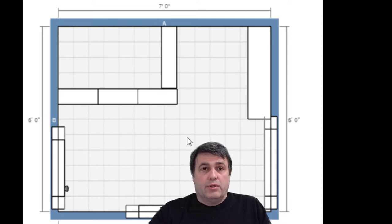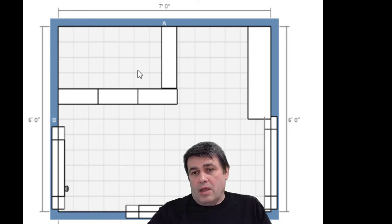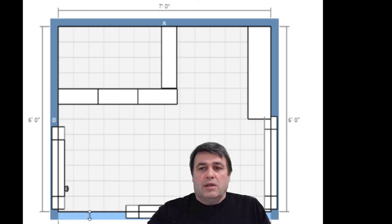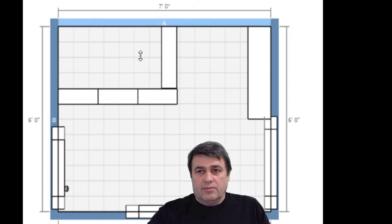Before you even start, you have to figure out the most important thing: where you have to run the drain from the toilet and sink, and where to get the water supply. In my case it was pretty easy because the main drain stack is close to the main entrance in this wall, and for water I have an extra washroom on the second floor — so I can pick up the water supply from there or even from the basement.